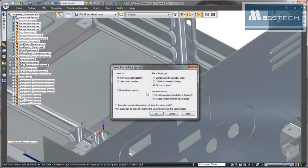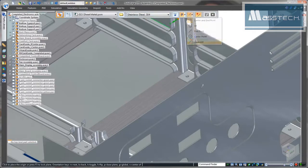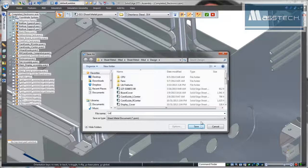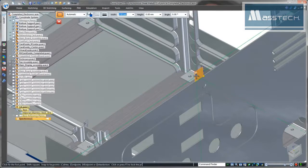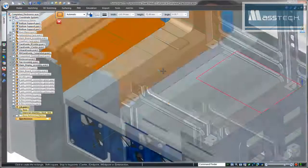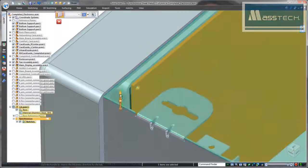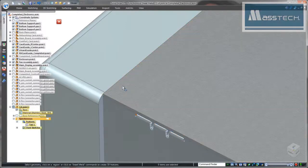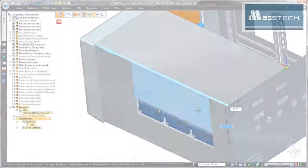Now we'll create the lid. This is where the power of Solid Edge top-down design is realized. By constructing our housing in the context of surrounding components, we can ensure all holes align and mating parts match the first time, avoiding costly rework and eliminating scrap. As before, we'll create a new flange just by dragging the lid panel's thickness face to the length we need.